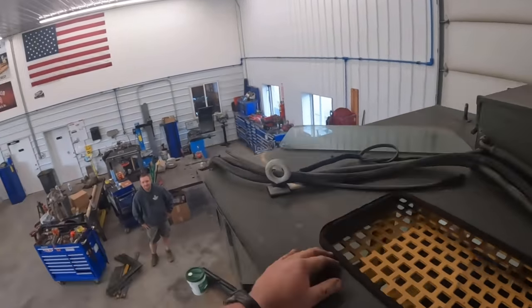All this stuff is super heavy duty. If you notice, this is a pretty short cylinder. It's actually curling that bucket back here. And the reason it's short and strong like that, they've got this big long arm here that's going across down through here. These loaders had exceptional breakout force, but a very, very well-built design on the loader frame. These pins are huge. That's probably like a 3.5-inch pin, and you've got big surface area to wear on.